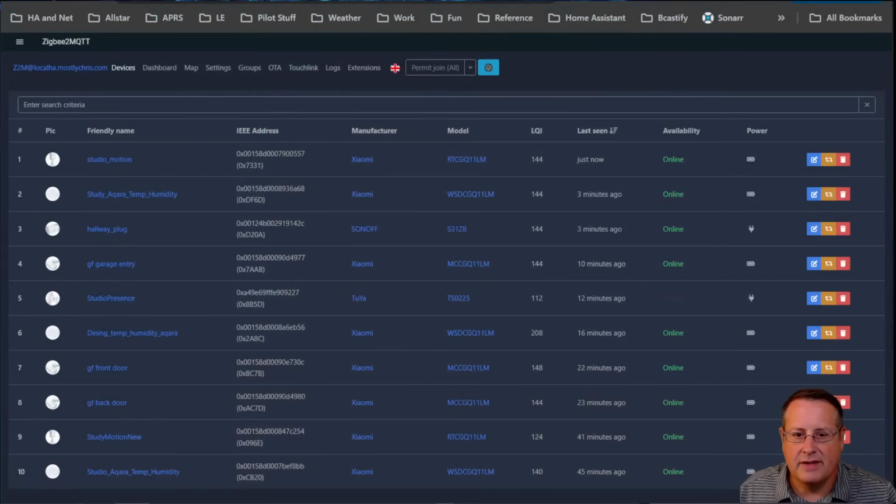Now let's talk about getting it into Home Assistant. This is a Zigbee device, and it does not come out of the box capable of being used in Zigbee2MQTT. Let me talk about that. I'm using Zigbee2MQTT, the add-on here in Home Assistant. The reason I use it is that there are a number of community developers who will take devices that are either bleeding edge or just non-standard Zigbee stuff, which Zigbee has almost no standards, and apply their engineering knowledge to get what they call converters or devices into Zigbee2MQTT.